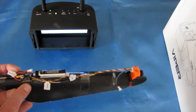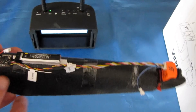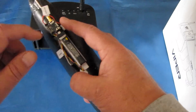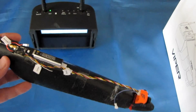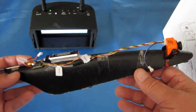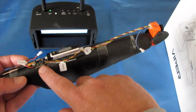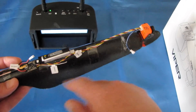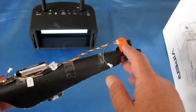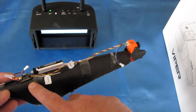Let's go over the transmitter real quick. The FX868T transmitter comes with this bundle. It's 25 to 200 milliwatts switchable, either through smart audio or using the switch on it. It's 37 channels, so it's FCC compliant in the United States. This transmitter, though, limits the power you can use in this system — it only accepts 5-volt input power. So even though the camera can go from 4.8 up to 36 volts, when buying this bundle and using this transmitter, you've got to keep the voltage under 5 volts.